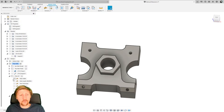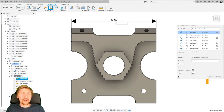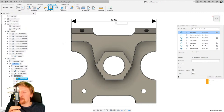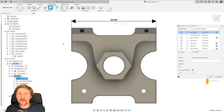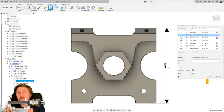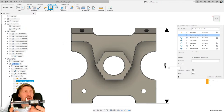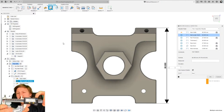I'm now going to right-click on my first-off and go to Record Manual Inspection. How cool is that — it's flipped the camera to exactly the position I recorded. Now, my calipers have a lovely little Bluetooth symbol on them. If I open my calipers, measure over the part, and hit the data button — it puts the number straight into Fusion and advances to the next feature automatically. No keyboard needed when you've got connected equipment.